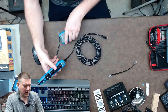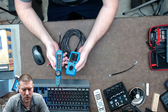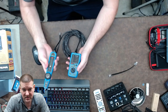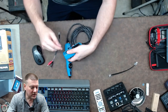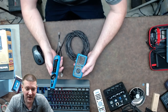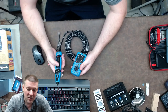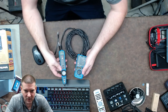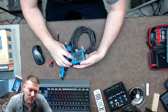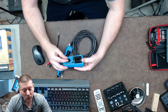Let's go ahead and test this — it's like a 50-footer. You see it going through the pins: one, two, three, four. You're going to be looking on the hand probe. You plug one end in, or you can plug it into a jack, then go to your comm closet. You want to make sure it scrolls through all the lights evenly — that way you know you've got a good cable. You can also do tone to test for telephones and continuity. But that is the old-style way of doing it.